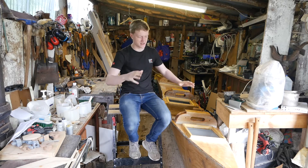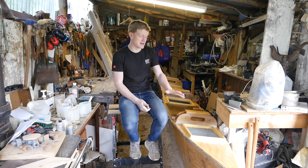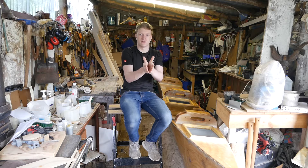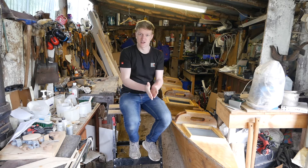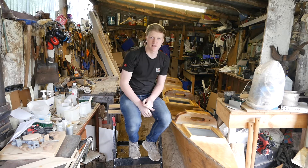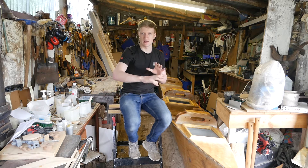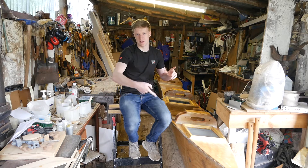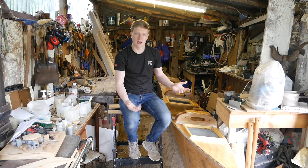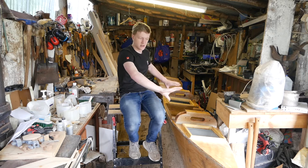I'm calling this hull design the sea blade design, because it's literally just like a knife blade — long, thin, and sharp — with a really aggressive deep-V shape that will allow it to cut through the water. I've been building the boat out of plywood mostly, using the stitch-and-glue construction method, where you cut out the profiles of the hulls, stitch them down the keel line, and fold them out to produce a hull really quickly. It's very strong because it's essentially just one or two pieces and you don't really need a lot of internal structures or ribs.